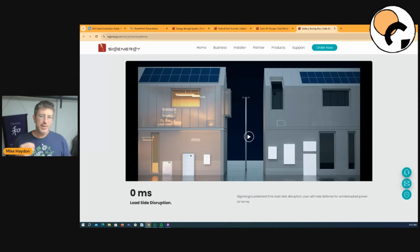We normally use what's called an AC coupled system, which is literally putting a grid connected solar inverter up, and it's important you use the right manufacturer. We put the grid connected inverter up on the house, and then that grid connected inverter, or PV inverter, AC coupled, will run the loads of the house. Any excess will shoot down that cable and back over to the battery-based system, which will take that energy and charge the batteries.